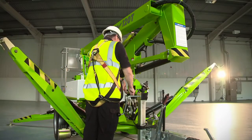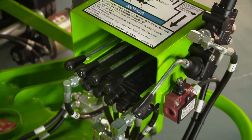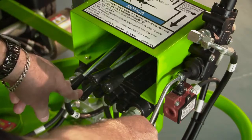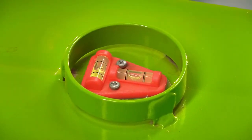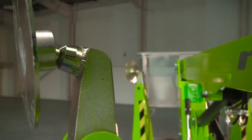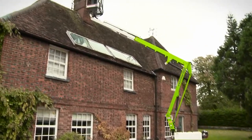The Nifty 120T includes hydraulically operated outriggers as standard for a fast and easy set-up. Operated from a control station near the tow hitch, each outrigger can be effortlessly controlled individually, but are usually deployed in pairs for easy levelling, even on inclines or uneven surfaces. Pressure-sensitive interlocks on all outriggers ensure that the machine is set up correctly and will not allow operation of the boom controls until all outriggers are safely in position.